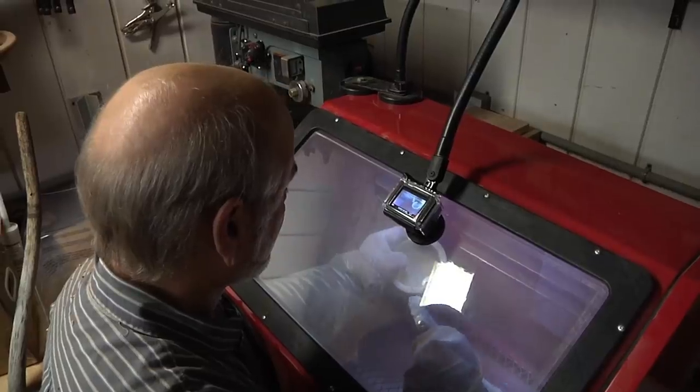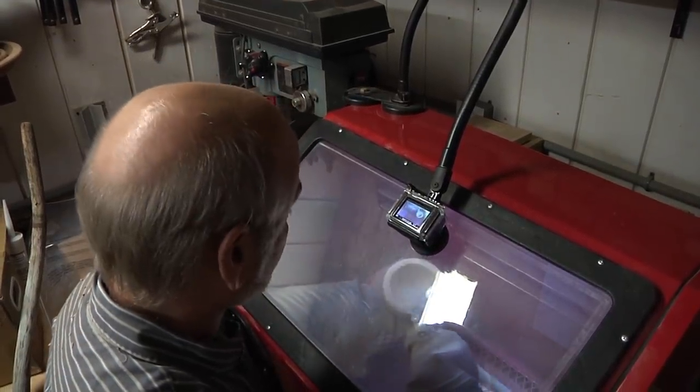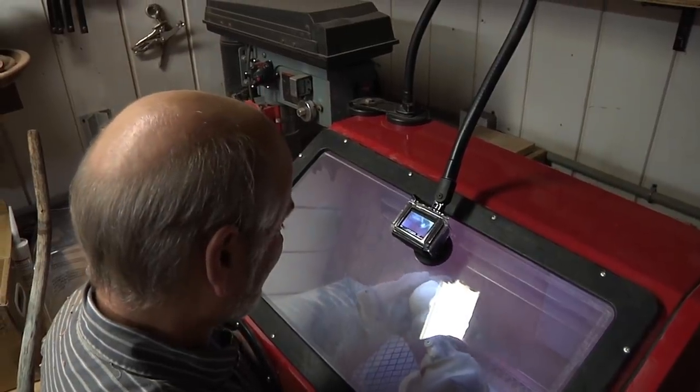I rounded these edges, so I'm going to go up here and blend them, burn them away a bit, because I want this to look antique. It's just about how deep you want to go and how much of an effect you want on the wood. If you don't have a dust vacuum system hooked up, you're going to have a real hard time seeing what you're doing after just a few minutes. And speaking of dust — remember, wear breathing protection if you're doing this. While I've got this in here, we made a sphere the other day where I had some really bad torn-out grain on the end grain. I think I figured out something to do to get rid of that, so we're going to sandblast this too. This is ash, so it's a much harder wood — let's see if it makes any headway.